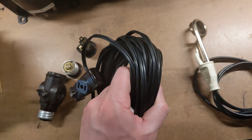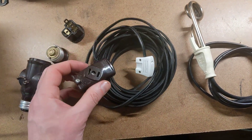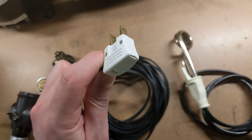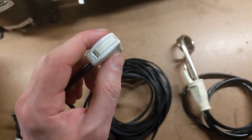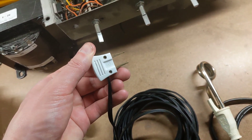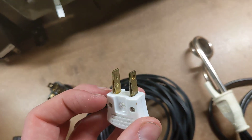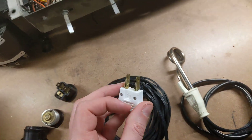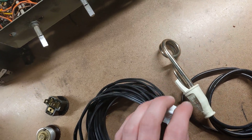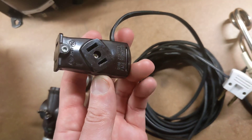This is a nice lightweight cord, obviously not designed for high current applications. To make the plugs as small as possible, I used insulation displacement plugs and fittings on the ends — the style of connection with pins that drive into the insulation and contact the copper in the cord. It is also non-polarized, so you can access non-polarized outlets where they exist.